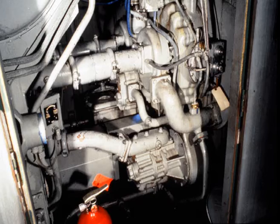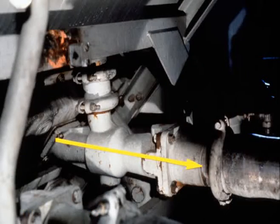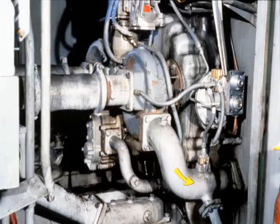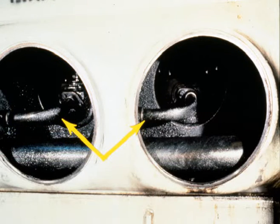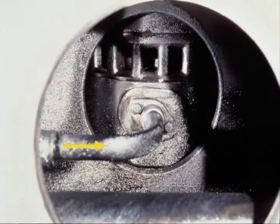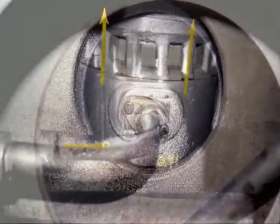Additional components include electric-powered cooling fans, an oil cooler, and a water expansion tank. During operation, the water pumps draw coolant from the oil cooler and water expansion tank. The coolant leaves the water pumps under pressure, forcing coolant through the pipe in each airbox, where each cylinder is connected by a curved tube referred to as the lower water jumper.